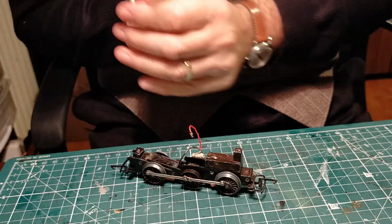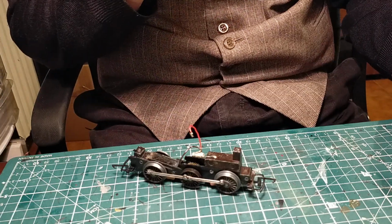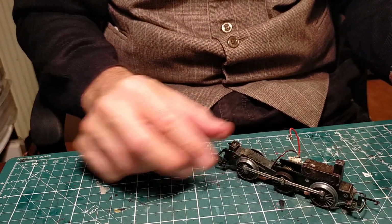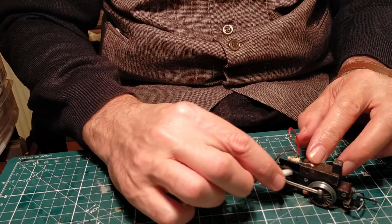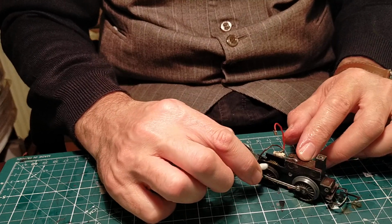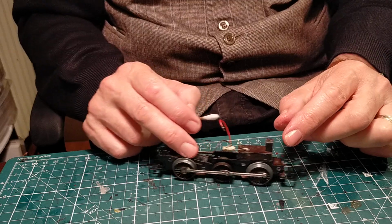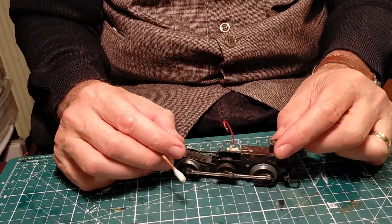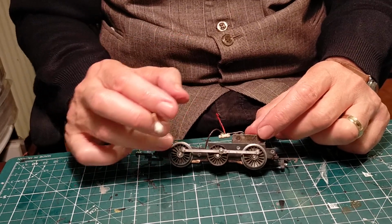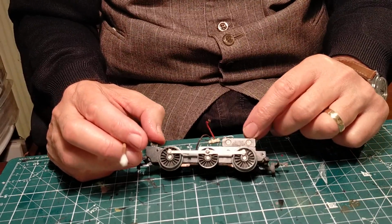Righto, very well. So my hands are as degreased as possible. Why is there an eraser there? I was using it as a wedge. Okay, let's do the... That's still greasy, that thing there. The last thing we'll do will be, when we fit the motor, we'll have to grease the main drive gear here, and then the very last thing I'll apply some sewing machine oil to the actual kingpins and to the connecting rods.